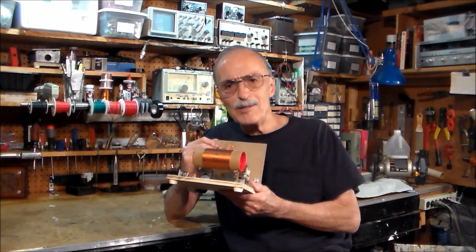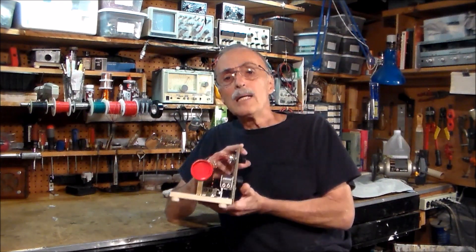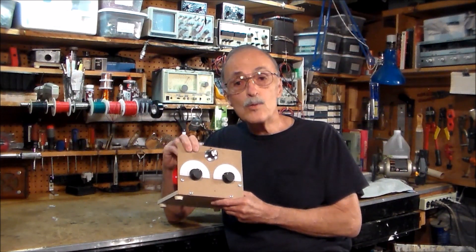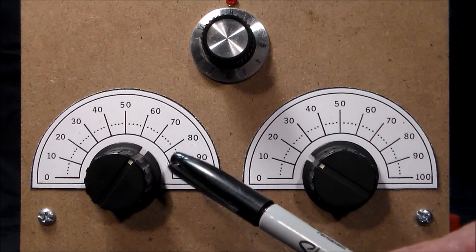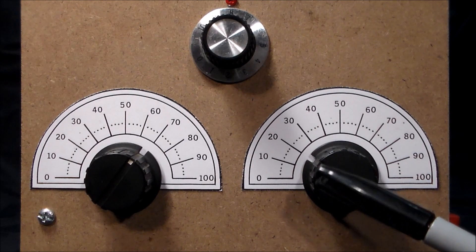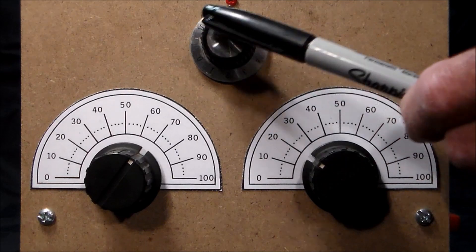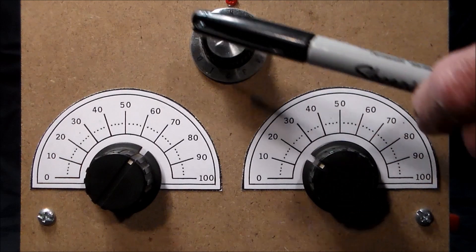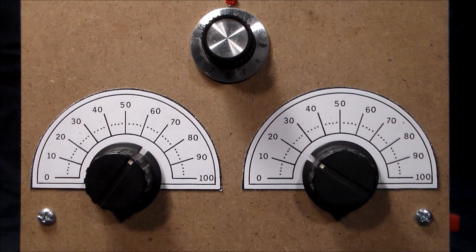And I think that's probably why they're so fascinating to many hobbyists today. Many people are building these radios — just look at the videos on YouTube. I'm going to begin by showing you my front panel and explaining the controls, what they do. My radio has three controls: main tuning, ground tuning — which is used to raise the set above ground potential — and a band switch.